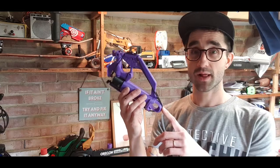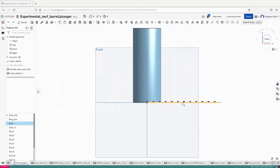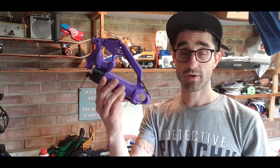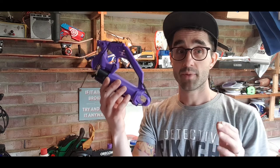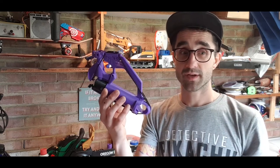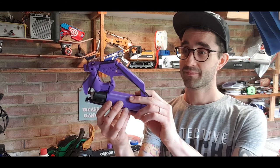How would I improve the plunger tube? The sleeve design relies on triangular-shaped locating pieces, which means there's very little plastic in contact with the sleeve itself — quite a weak point given the printing layers. I would probably change from triangular to something squarer, wider at the bottom. They're not really needed to keep the tube circular — the spring tension of the rolled-up plastic does that really well. So perhaps square locating pegs, fewer of them, would allow it to be more easily adapted and perhaps reduce the external diameter of the plunger tube.